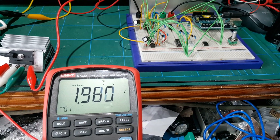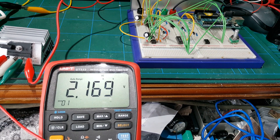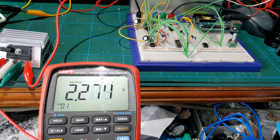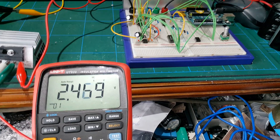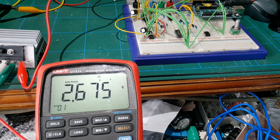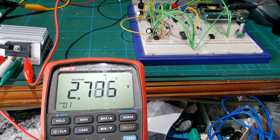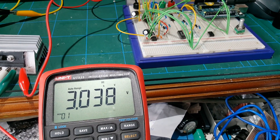So you see we've got some time now to store that energy. You can see the voltage rising across the pack. We're going to have exactly the same effect that we did on the little cap, but it's going to take longer. You can hear the motor RPM slowly rising as the voltage is rising in the capacitor bank.